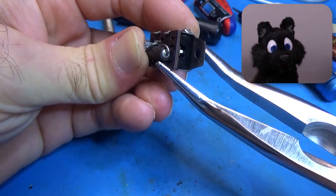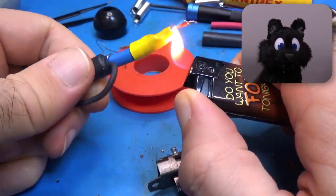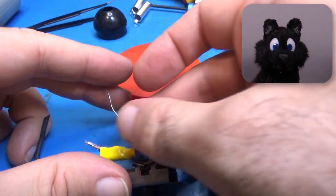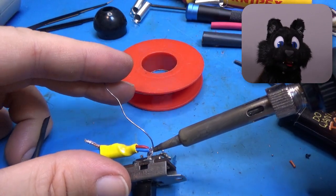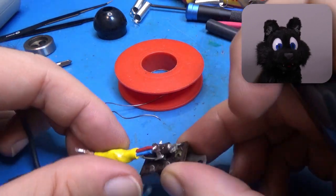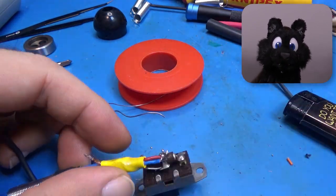The probe originally has a regular coax cable, but I really like how flexible that Twinax one is that I got for the HF probe, so again, until I find something better, I'll just use the same one on this probe and tie the two conductors together.